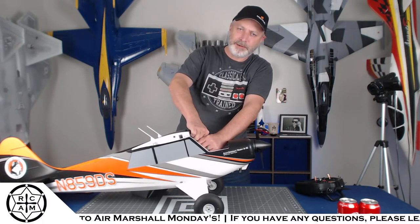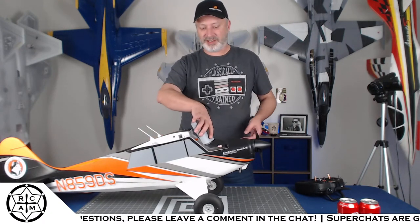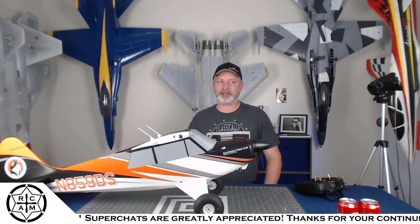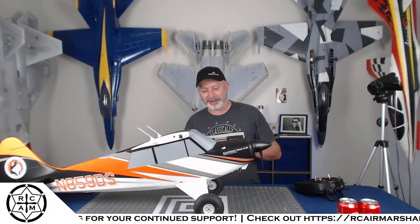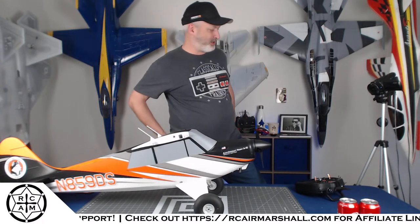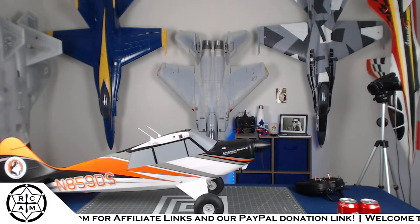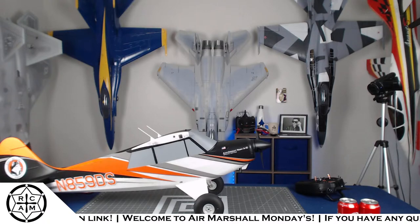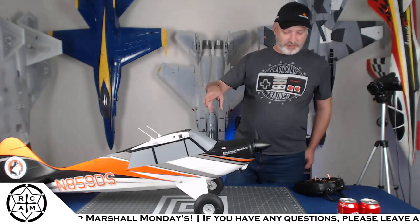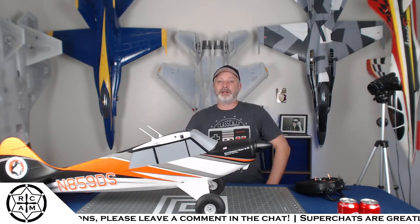Yes, it unloads in the air, but how much does it unload? And how much headroom do we have beyond where it says max continuous current and peak current, because every ESC has that too. Usually the number value that you see on an ESC, the one I put in here is 60 amps, for example, it's actually got a peak of... I've got the box right here. I think it's got the specs on the box, or in the manual. Yep, so the Avian 60 amp ESC, which is what we have in here, has a continuous current of 60 amps and a peak current of 80.